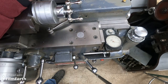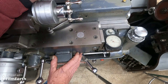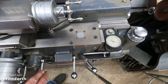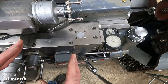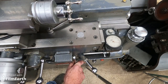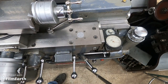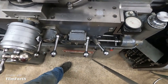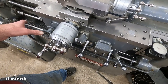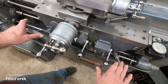If you don't have lead screw reverse, what you've got to do is try to have the tool ahead of the work. And when you engage the half nuts, let the carriage travel an inch or so. Even put a little bit of tension on the hand wheel as it's approaching the thread to help settle those half nuts in.